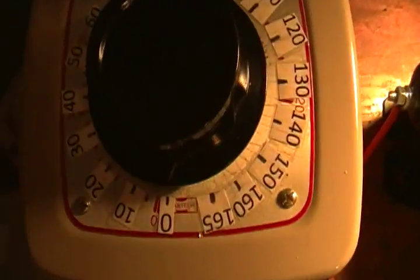The arcs are pretty thick for 30 milliamps, so I'm going to go ahead and show you. That pin right there is ground, that one's neutral, and this one's hot. I'm running it through the Variac because I want to crank it up a little higher than it's supposed to go — it doesn't hurt these things a little. Not like the MOTs, which don't last more than five minutes, as Photonic Induction says. This right here is a half-wave rectifier I made out of 13 1,000-volt diodes for 12,000 volts, so it can handle up to 13,000 volts. Always makes things nice and stable.